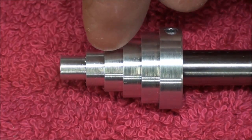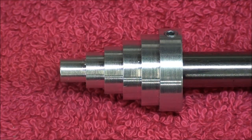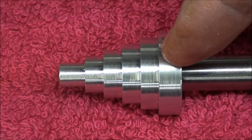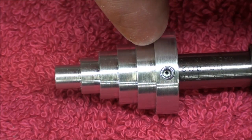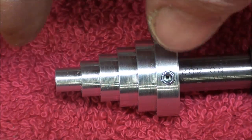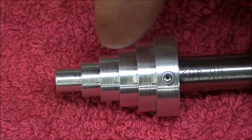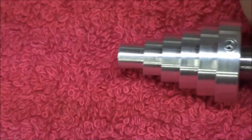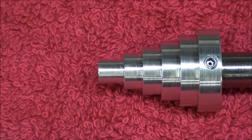You can put as many steps on here as you want, or whatever sizes you want. I have put on a quarter-inch, three-eighths, one-half, five-eighths, and three-quarter. The very largest step is an undetermined size — it's a place to put the set screw and acts as a shoulder for the last three-quarter-inch step. The set screw serves two purposes: it holds the edge finder or the wiggler in there, and it will hold the raw stock to a mandrel while you're turning it on the lathe.